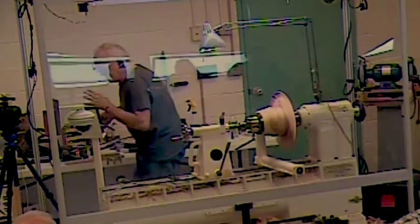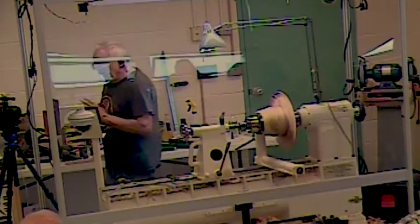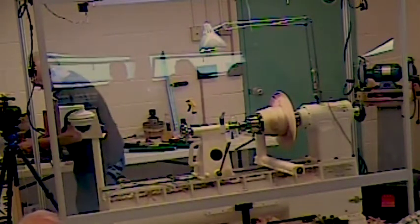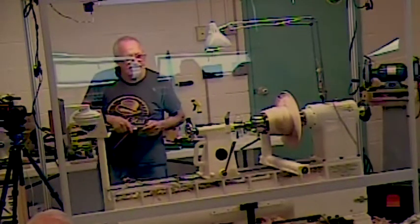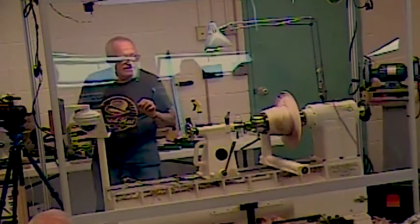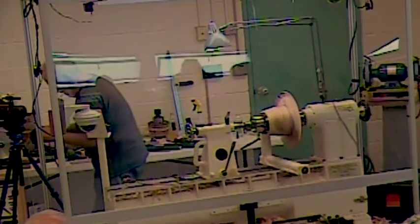And like I was saying about these wheels, they're just fabulous. The perfect roundness makes it so that all you have to do is take away the tiniest amount. This steel is not really dull, so the amount of steel you need to remove is minuscule. And these can do that, especially this one, which is 600 grit.